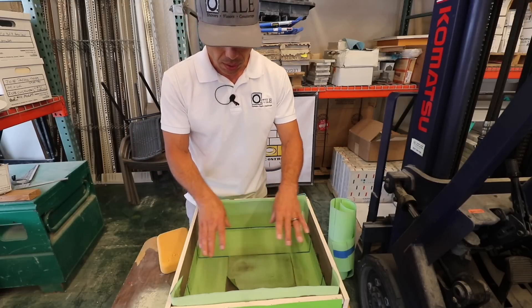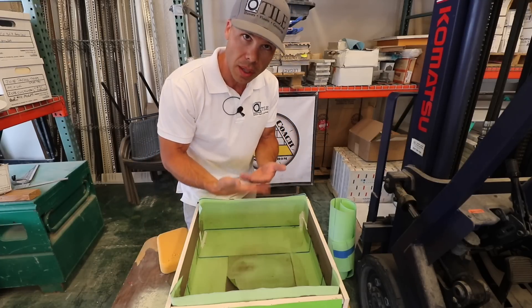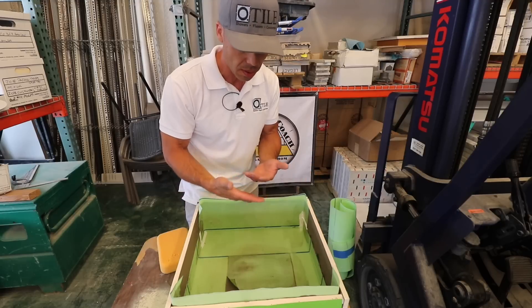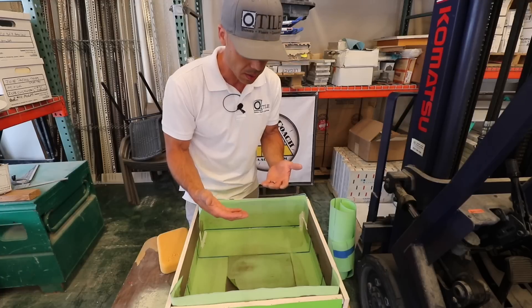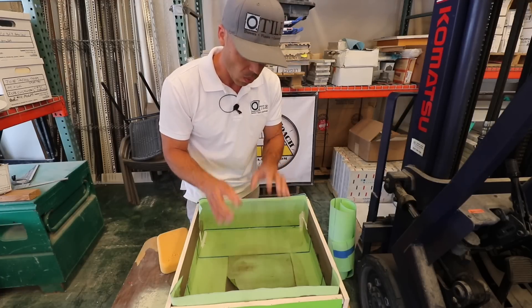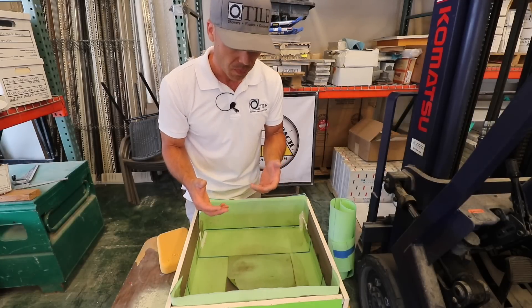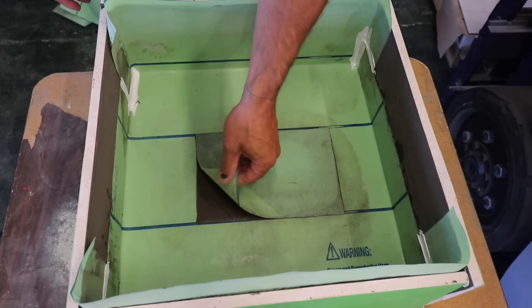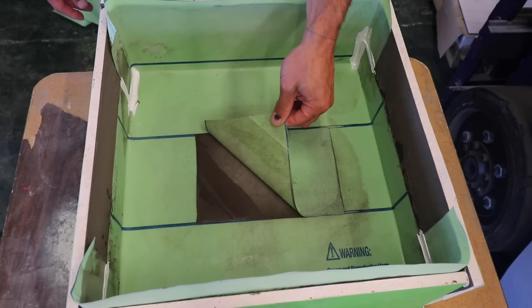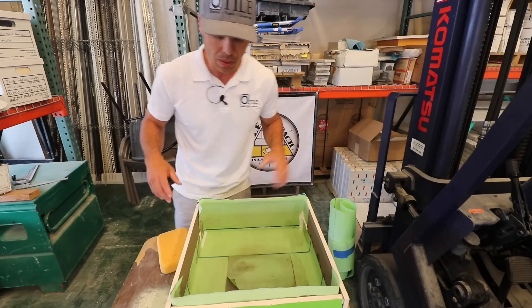I also did a patch where I just took a patch of the Value Seal and put it on top of the Value Seal. For one, I want to see how much water penetrates underneath the two layers, like how KERDI works — does it seep under just like KERDI does? And I also want to see the adhesion: how well is it adhered? Because it's lacking the fleece that KERDI has, is it going to have as good of a bond? I hate when these membranes just peel off really easy. So that's what I'm going to be testing — I'll go ahead and start taking this apart.